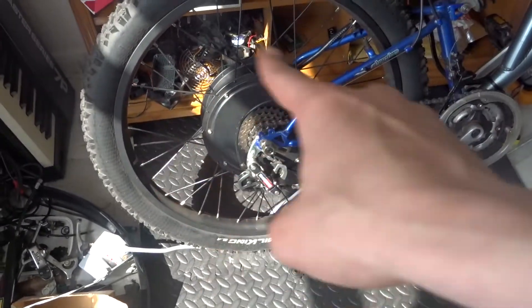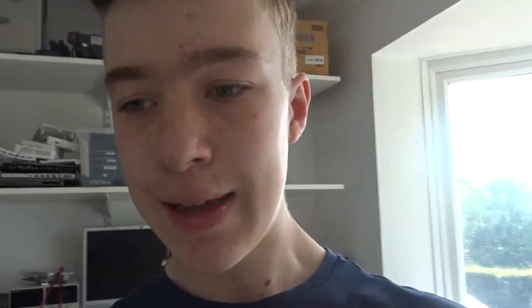Especially the battery readout, because you know when you're going to run out rather than just guessing. The speed and distance work well — they took a bit of time to calibrate but now they're working fine. Speed reads in miles per hour, so it just took a bit of math to convert the reading from the VESC. This motor has multiple poles — essentially segments of the motor — so it's converting the VESC reading into miles per hour, and speed times time gives the distance. The current is also useful because the throttle sends a constant current to the VESC, so it's handy to know what power you're running at and how much battery life you're going to have.